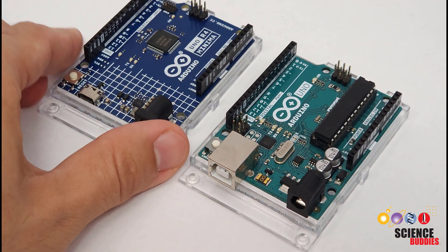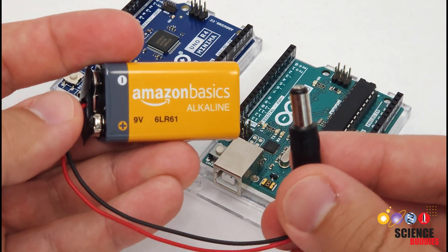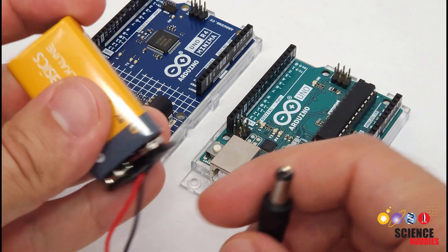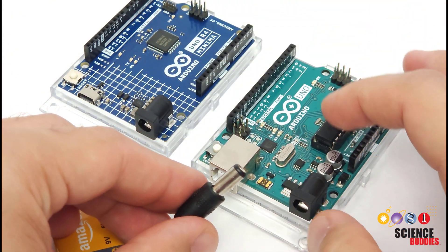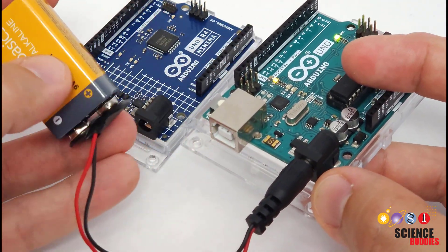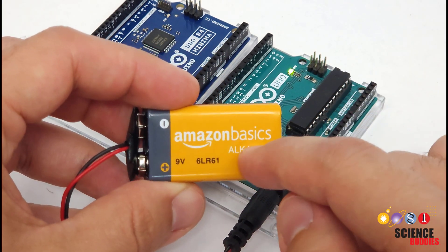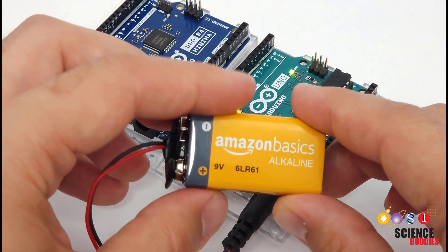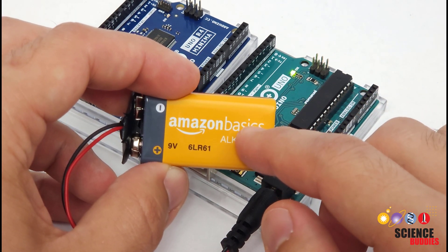What if you want to have a mobile project — something that moves around and does not need to be tethered to a wall outlet? That is where we start talking about batteries and the snap connector. Here we have a 9 volt battery — and remember, 9 volts is within the range accepted by the voltage regulator for either the R3 or the R4. There is a snap connector on one end that snaps onto the battery and a barrel plug on the other end, which is center positive and matches the dimensions for the Arduino barrel jack. But if you are doing something with lots of motors, like a robot that drives around, this 9 volt battery is going to drain very, very fast. It is okay for longer battery life with something like an LED blinking intermittently, but if you're trying to drive a lot of motors, the battery is going to die very quickly.